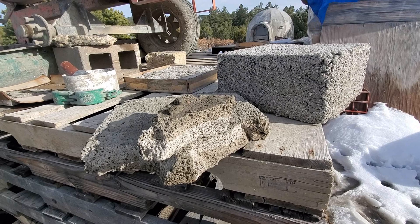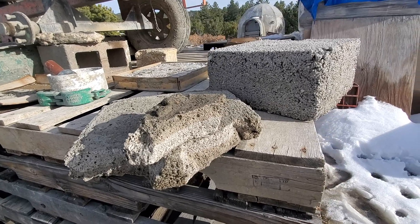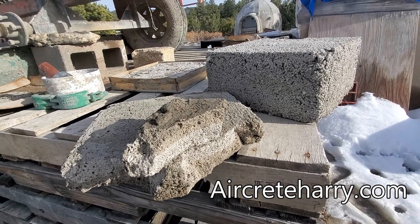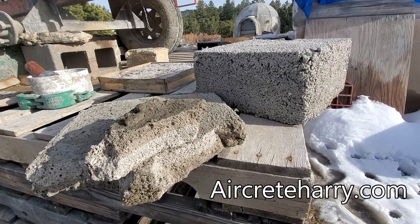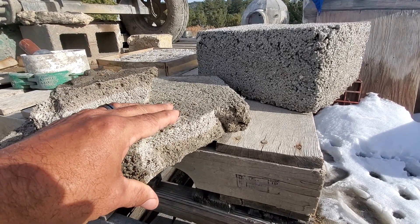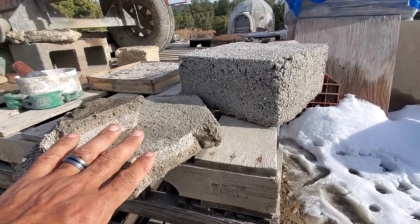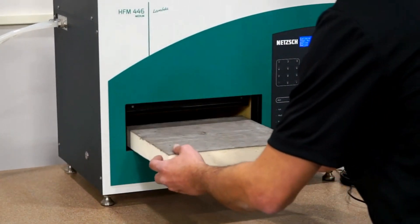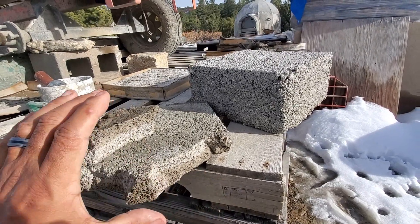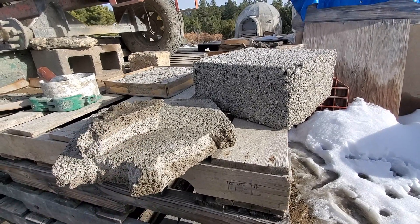What's up everybody, this is AirCrete Harry and in today's video I'm going to be talking about the R-value test that needs to happen to the aircrete samples. I currently have on my website aircrete harry.com a listing for a licensed R-value engineer test. What's involved is basically just sending a sample of the aircrete or the styro aircrete or the epic mix to this engineer, who will place the sample into his machine which will put pressure on both sides and heat one side and cool the other — by doing that they're able to measure what the R-value per inch is for any insulative material.